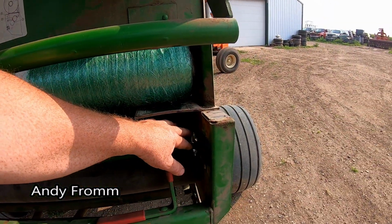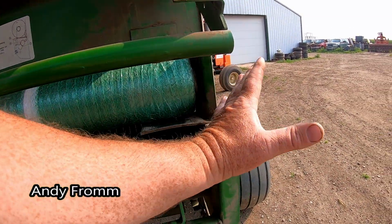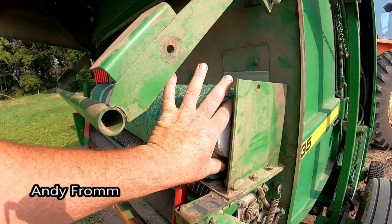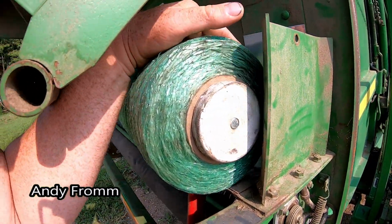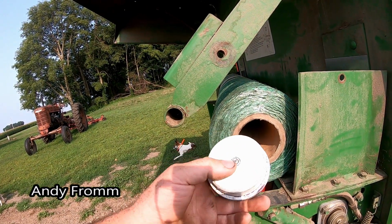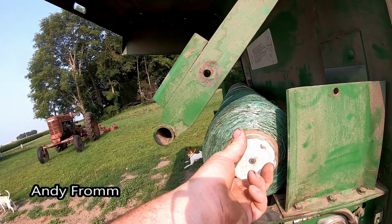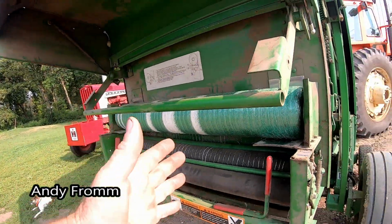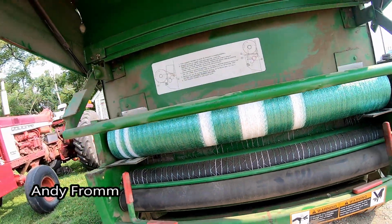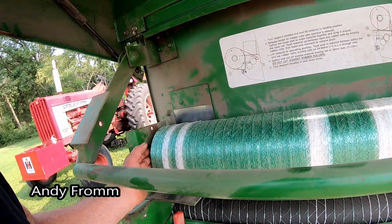I have had trouble with the wrapping on either side of these rollers, and it seems to me this roll will get off to the side, get in there, and wrap. Well, I made these pucks that it's just some scrap that I had laying around. This is PVC. I actually had to glue two pieces together, put a bolt through it, lay that down. But that fits in there, and it prevents the side-to-side movement. So I'm hoping that I'll keep it pretty well centered in here, and everything will work good in the road ditches and whatnot.